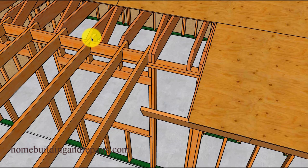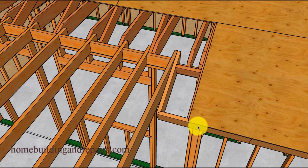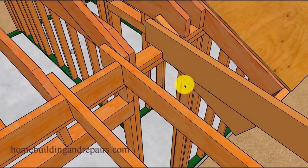You could run into this same problem with roof trusses or other types of framing that might require layout modifications for the location of your patio roof rafters. For example, you might have 24-inch on-center roof rafters and 16-inch on-center ceiling joists — if the layout measurements for either change, you might need to change the layout measurements on these also. Next up let's go ahead and install our fascia board, which is probably going to be the trickiest part of this entire project.